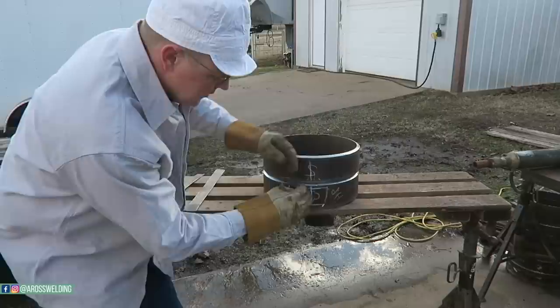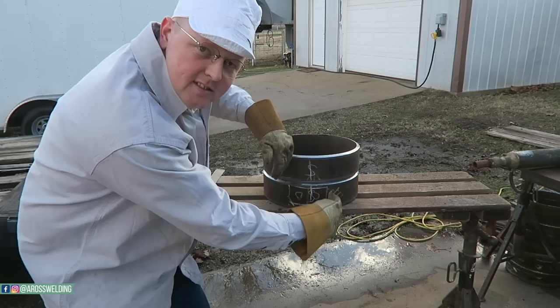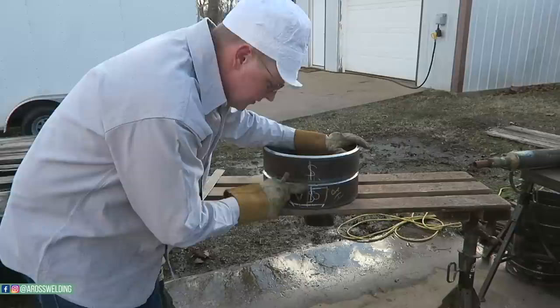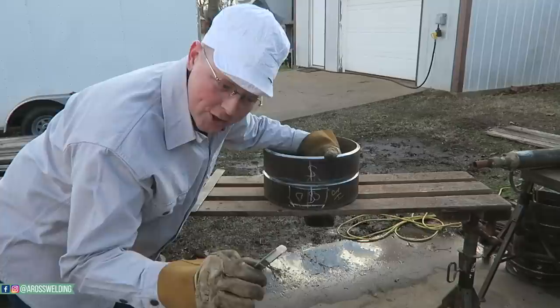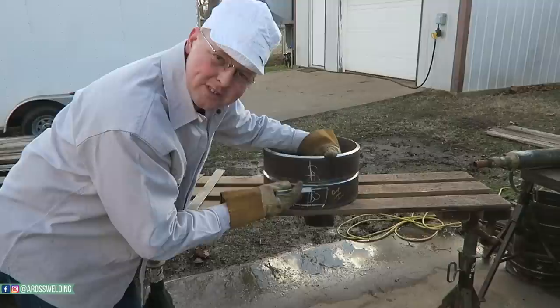Out in the field, on new production, they'll actually put the seams at 10 and 2 on the top when they're laying pipe. But on a test, you line up your seams. That way you don't pull a strap out of your seam. Very rarely will you pull a strap out of the top of your weld. I have heard of a test where a guy has made welders pull the straps out of the top, but that is a very, very rare thing that hardly ever happens.